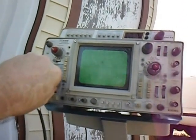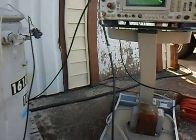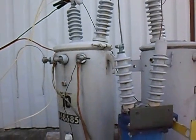But it is working, and this experiment showed — especially as we turn off loads — that the rectangular waveform does transmit through the transformers. We'll post this video and see what everyone thinks. Our transformer is showing just a little bit above 1400 volts right now. These are 14.4 kV transformers, which makes sense.